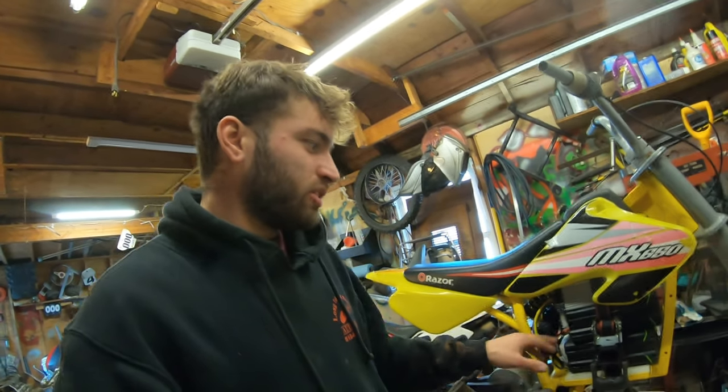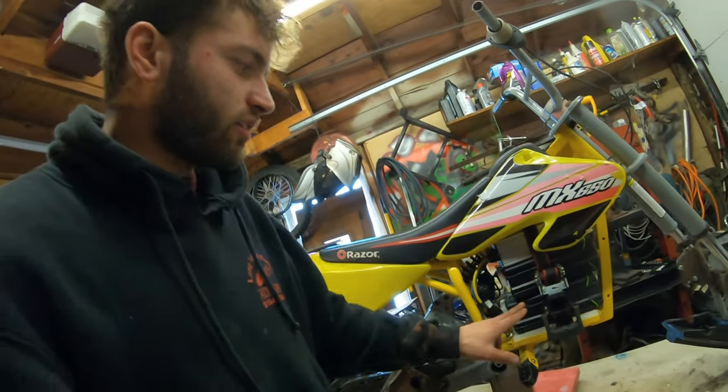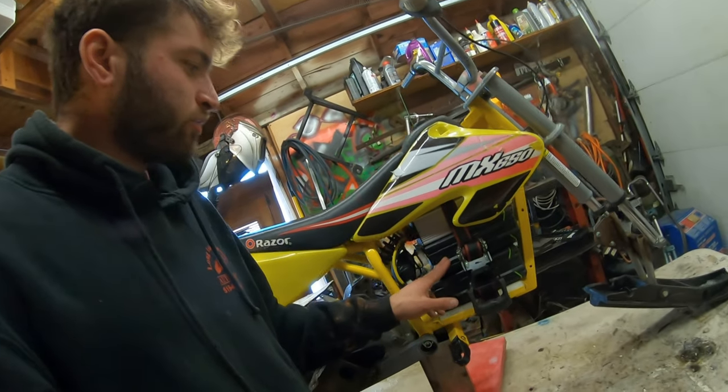Now, to complement the amps from the new controller, I am going to make a different battery pack. We are no longer going to use the 80 volt Greenworks batteries that are in here. I think I'm going to convert this thing to LiPo. So we're going to do RC car batteries, big ones. Probably going to do 4 of them. And I also want to make the battery box watertight.